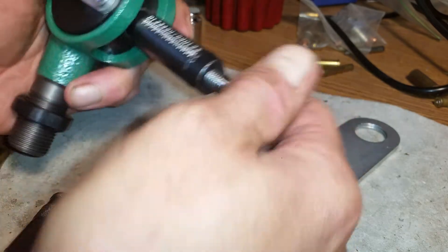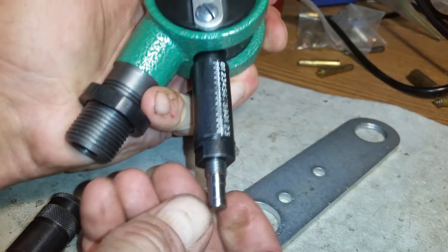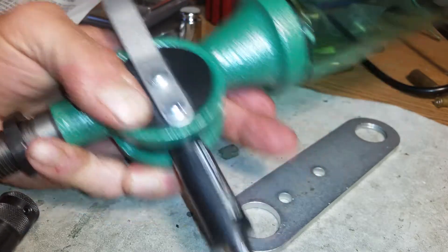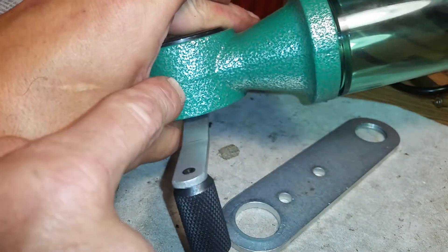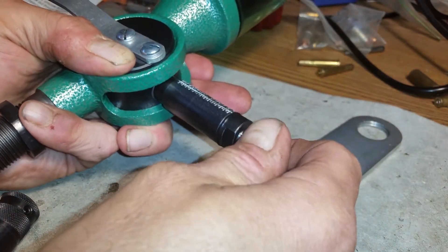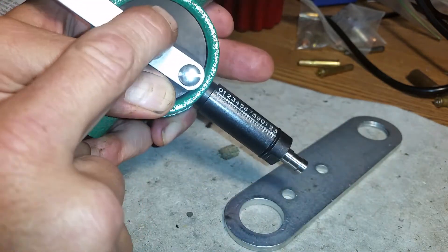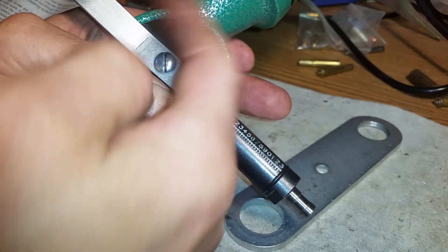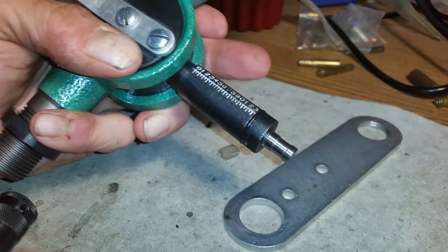What you're going to do is move the travel of the feeder to about halfway, so that this screw is facing straight towards the back of the drum, and then just twist it in until it touches. It's touching the back of that drum now, which means it should be flush with the drum up against the casing. Nothing tight — just touching it there.